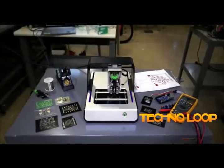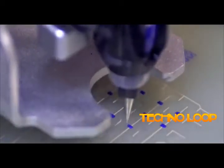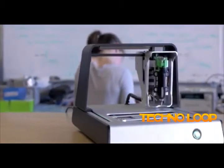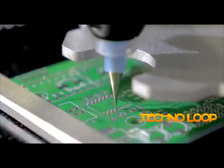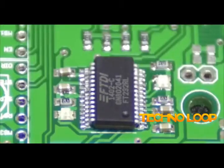We designed this tool to help hardware developers see their ideas come to life faster than ever before. We use conductive and insulating ink to create fully functional two-layer circuit boards without ever having to email files around or wait for the FedEx truck. But this is so much more than just a prototyping tool — it can help you in any stage of development. For small batch runs, the printer is also a standalone solder paste dispenser. Once you add the components, it will reflow the board as well.